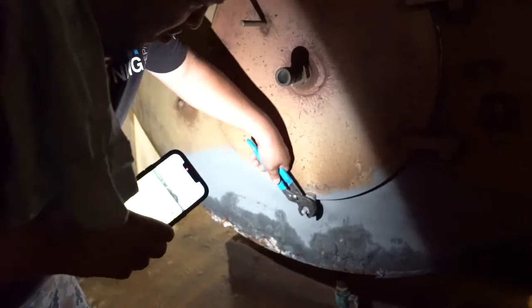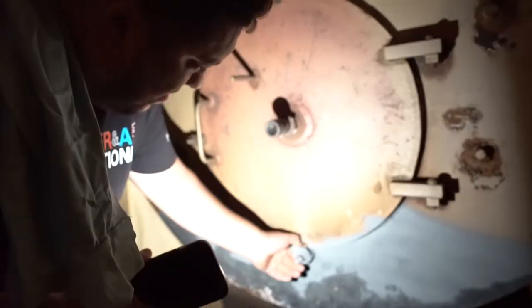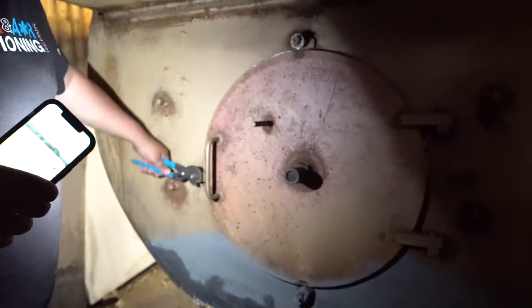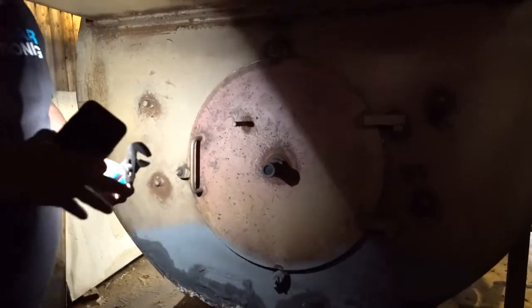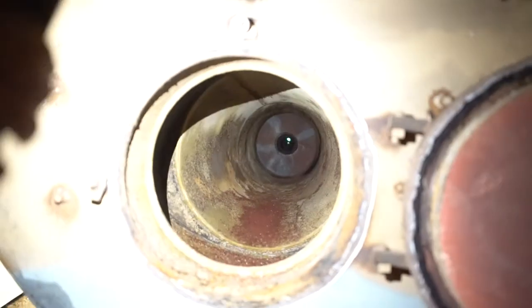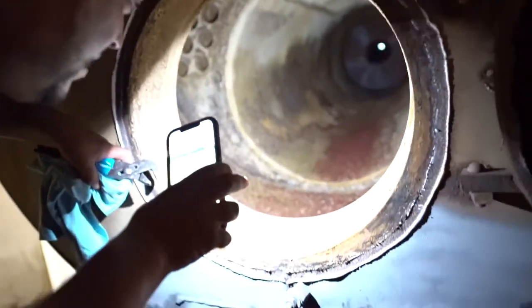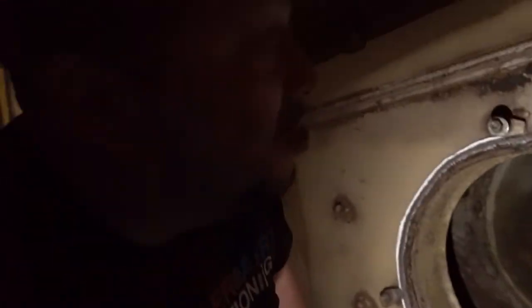I'm going to open up this manhole door and take a visual look inside the boiler. It's pretty disgusting in here — it's what happens when you don't service and maintain it. The inspector was here not too long ago and said this has to be addressed. Better they do it now than later because winter is approaching. This is what's called the chamber — this is the rear of the boiler. This is a Rock Mills boiler. There's a lot of scaling here and it needs to be serviced. That's the front wall where the fire comes out from the burner. Right now I see a lot of scaling and a lot of rust, which is pretty typical. I definitely advise doing a hydrostat on this boiler to really look at it. It could be corroded from the bottom, but the only way to do a real check is to open up the cover and take a look. I'll keep you guys posted.